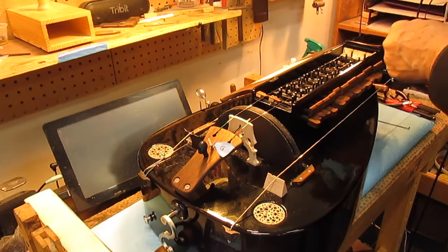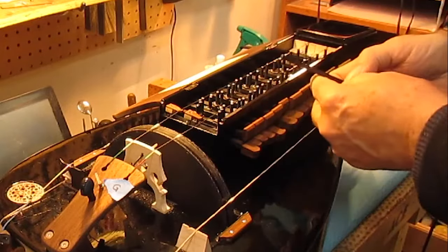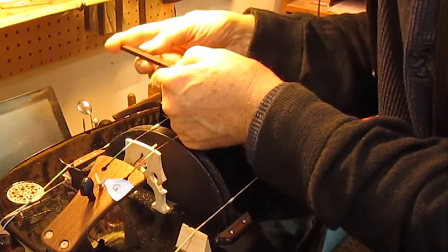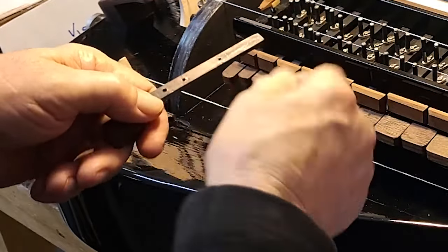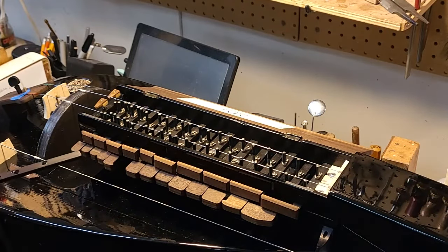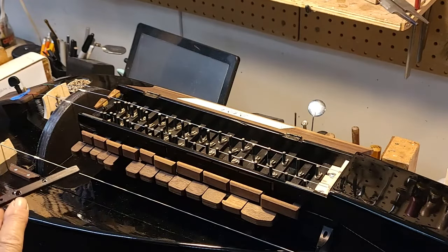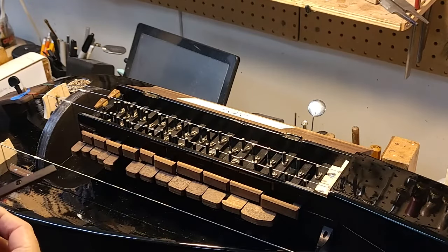What I have to do is drill this out, put a little patch in it if necessary, and then reseat that screw. We're going to inspect this — we might just shore this up with a drop of super glue to seal all of these grains and any loose stuff in there. I thought we were going to have to drill this out and bush the hole with an ebony plug and then re-drill, but I'm pretty confident the super glue is going to take care of the problem.